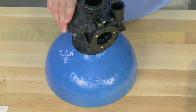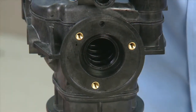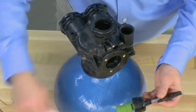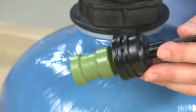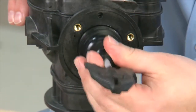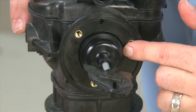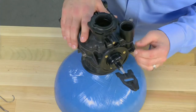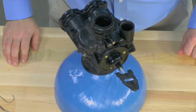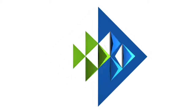When we install the last seal, make note that it should sit back from the front face by about 3/16ths of an inch. This allows room for our piston to seal up against the side of the body. When we install our piston, we add a small amount of lubricant to the o-ring seal on the cap. We then press the piston in straight, making sure it seats. It is normal for this to sit proud of the front edge by about 1/16th of an inch. This will compress when the back plate is reinstalled. The remainder of the parts are reinstalled in reverse order of removal. Good luck and thanks for watching.